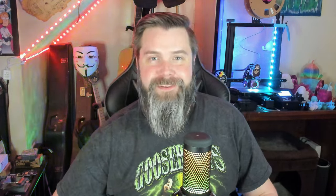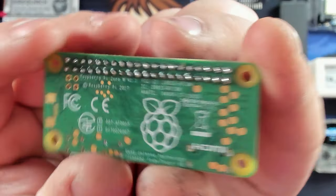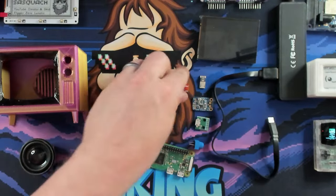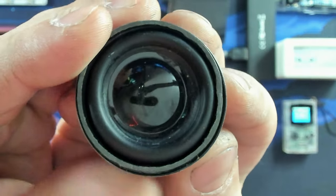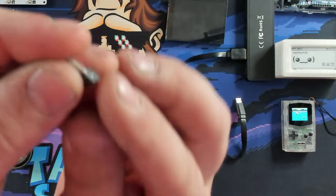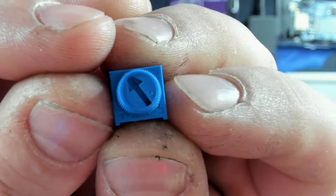We're going to start off by setting up our Raspberry Pi Zero, but first let me show you all the parts we need for this project. The first thing we've got is our Raspberry Pi Zero — I already soldered the headers on. Just be careful that they're nice and straight. We've got our SD card, and a 1.5-inch 4-ohm 3-watt audio speaker running mono. We've got a micro USB solder plug, and we're basically going to be making ourselves a little USB cable.